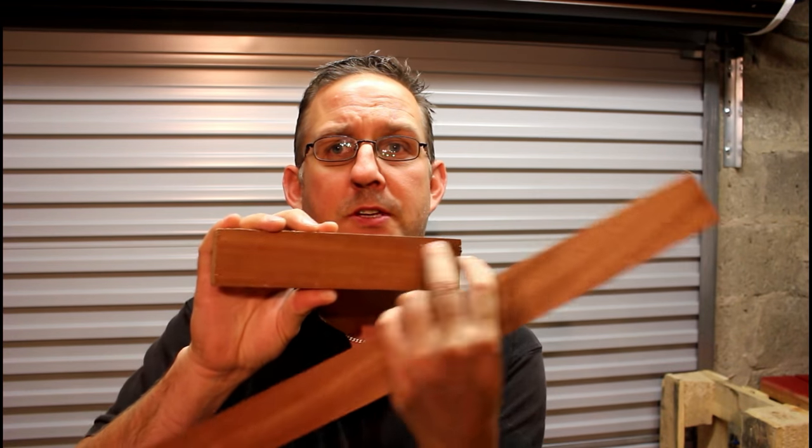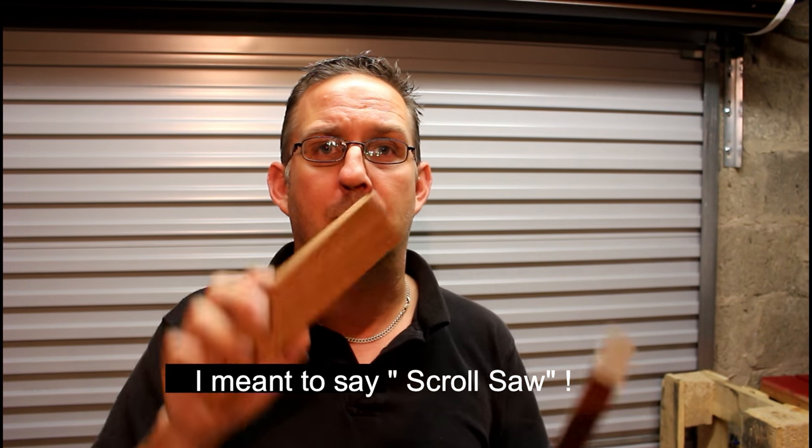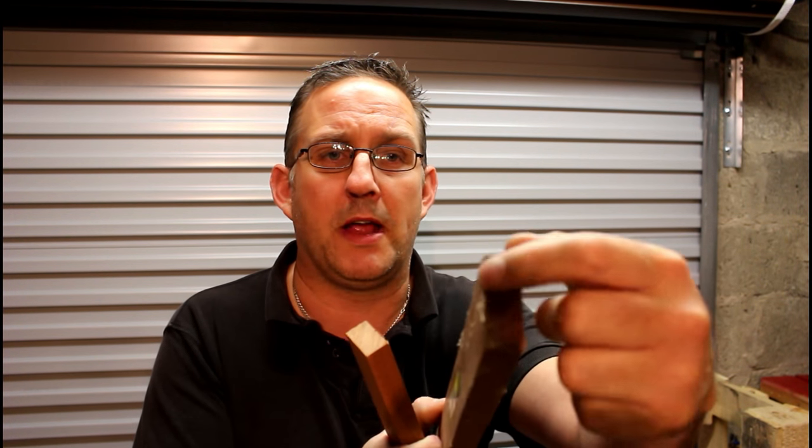We're going to cut two holes in either end, and we're going to route out the middle. And then with this part, we're going to rip down on the table saw. We're going to cut it down to about 1/8 strip, and that's going to form the lid and the base as well. And then we'll glue it all together. It's going to be a sliding dovetail box. Finish off with a bit of Danish oil and some spray lacquer, and it should be done.